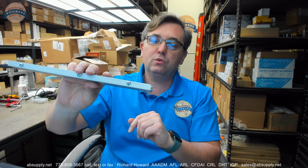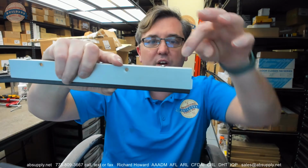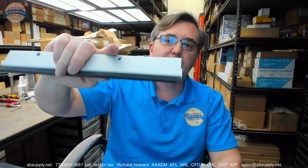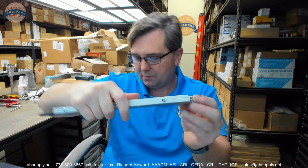You will want to order your pieces a little bit longer, obviously. Not tragically longer, but I'd probably order the next length up, it's sold per foot. So if you needed 90 inch, you're going to order 8 foot, let's say, and that will give you adequate length. If you were doing 36 inch, I'd probably order a 42 inch on the header. I would order the next longest piece, and I would probably just order it 2 inches longer so that I didn't really get into interfering with my adjusting holes. Just enough to be able to take off is what I would end up doing. Okay, but you'll need it a little bit longer just to get your saw blade on there and get it cut very accurately. Okay.